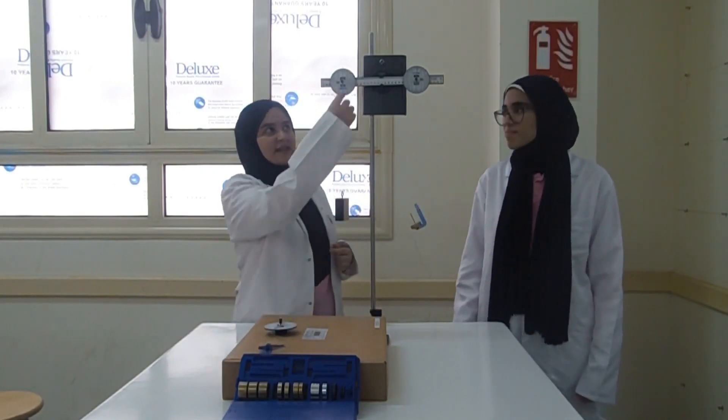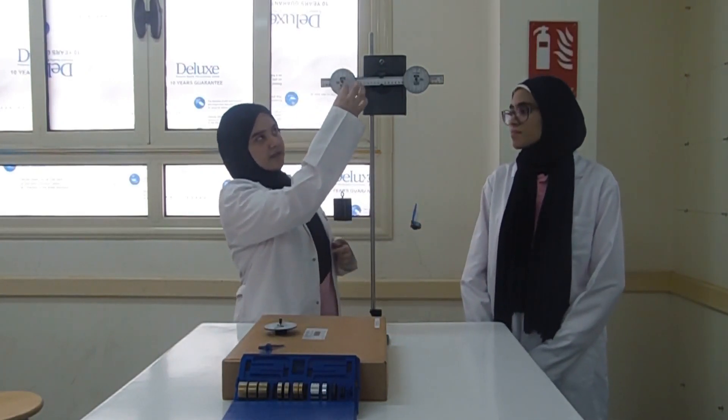Now the system reaches equilibrium, so we will read the length of the arm from the reading here, and use it in the law of moment in order to find the mass of the unknown block. Please don't forget to measure the mass of the hanger and the protractor on the sensitive balance plus the 70 grams of the known masses. And also the mass of this protractor, which is the same as the other protractor, because we will need it in our calculations.